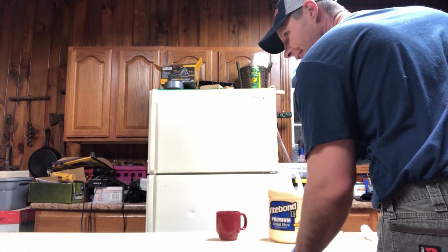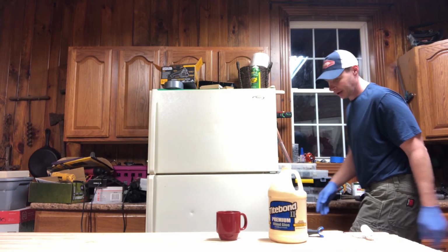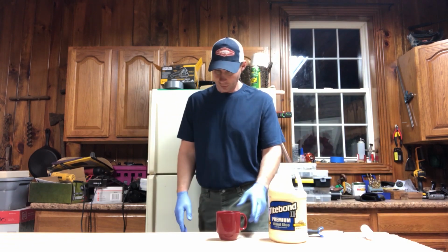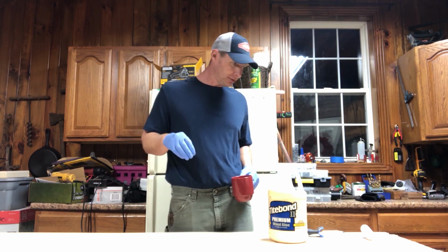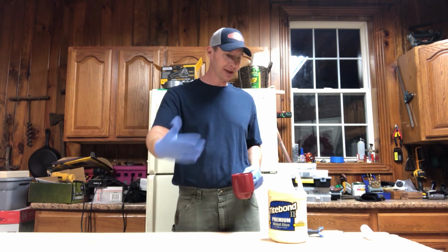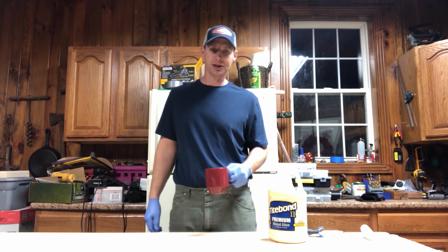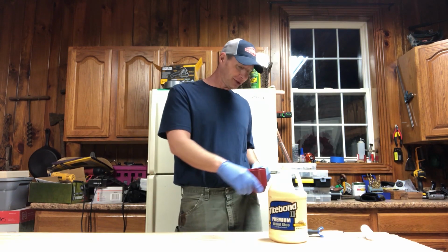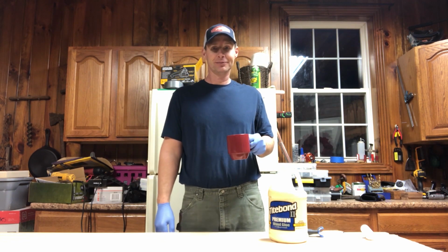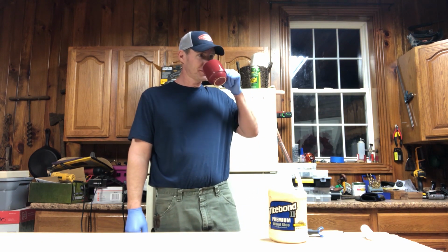I've got my boards all laid out here exactly how I want them to be glued in. So I'm gonna lay them over, apply the glue, stand them back up, do the next one. I've got all my clamps pre-adjusted because it says you only got 6 to 8 minutes of working time, so I don't have much time to mess around.